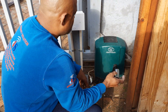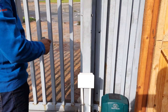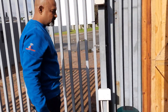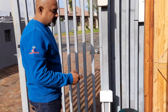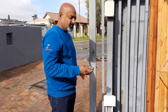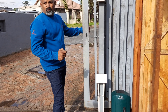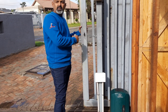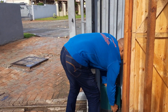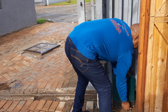Now you can press. Whenever you do that, it's going to move slowly. Once you pass the magnet, you can pass it down. Another thing — once you put it on auto, before you press the remote, you have to move the gate with your hand, and then you're going to hear the clicks. Let me show you. That is very important.